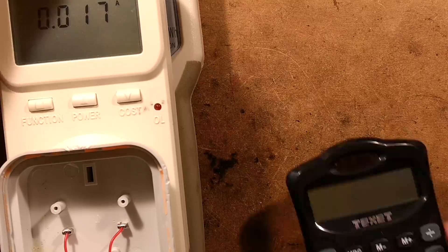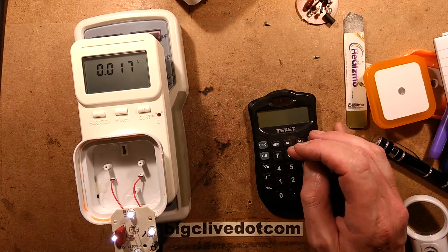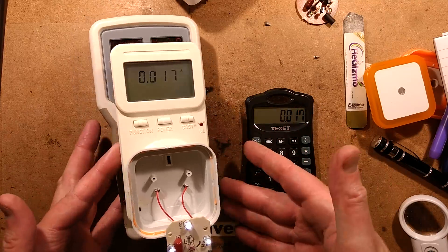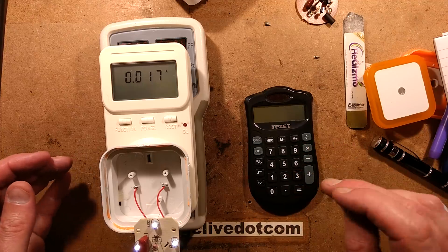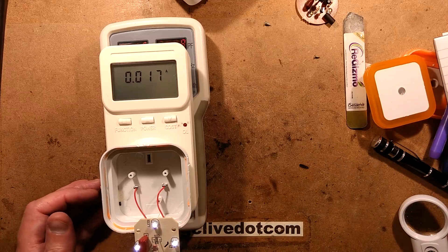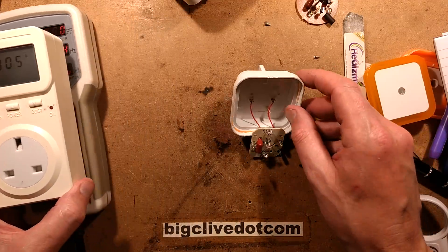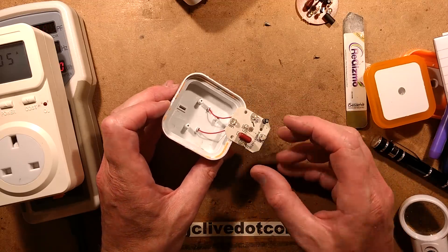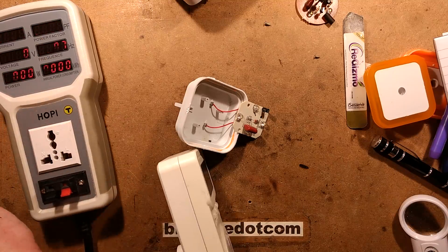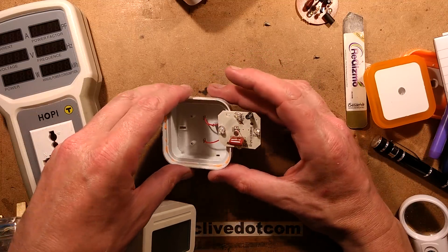Let's see — if it was being measured as apparent power... let's zoom back out so you can actually see it. 17 milliamps, 0.017 times — what's the voltage at the moment? 245 volts — so the apparent power is 4 watts, which is still negligible. It would cost about £4 to run per year, even if they measured that. But if it was actually being metered properly as real power, it would be negligible — it would not even show up, it wouldn't cost a penny to run effectively because the power is so low, even when it's bridged out. So I guess it was just maybe a component selection issue that was causing problems there. Interesting.